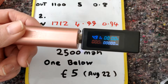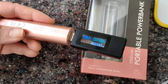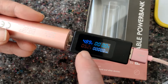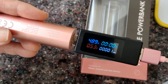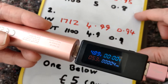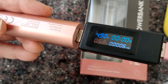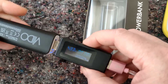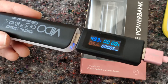I'll just do a voltage check — it's nearly 5V. There's no amp reading because there's nothing connected to it. Here I'll charge up my phone. Usually it goes about 0.95A — that's when I'm charging it up actually. When using it, I usually get about 0.9 to 0.8 amps. Maybe my phone's nearly fully charged — it's slowing down. Here I'm getting 0.53. Trying the Poundland one just to double check — it's doing the same. It must be my phone slowing the amperage down because it's probably nearly charged.